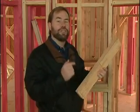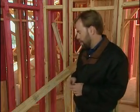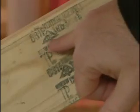Being environmentally friendly, it's a good material to use inside your home. To check for quality, always look for the grade mark on a southern pine stud. The first thing I see is that it's a number two grade stud — that's a really strong stud, perfect for residential construction. I can also see who the manufacturer is because there's a GP logo — that's Georgia Pacific. Plus, I see the KD-19, which means the inspector certified it was dried in a kiln to 19% or less moisture content. That means it's not going to mold or decay.